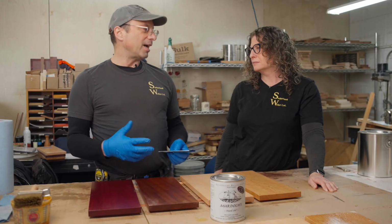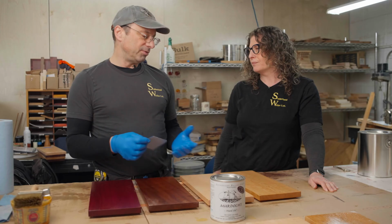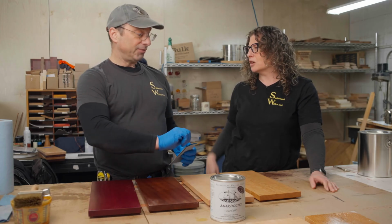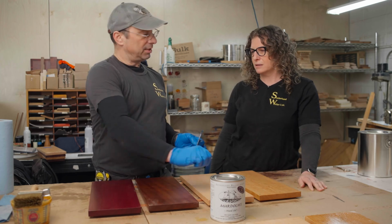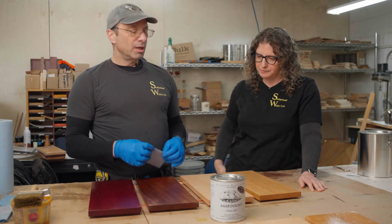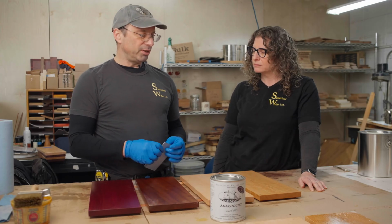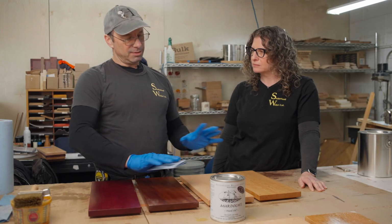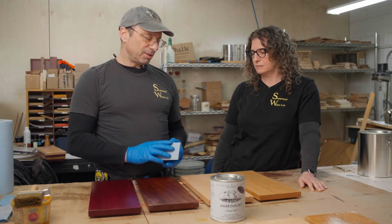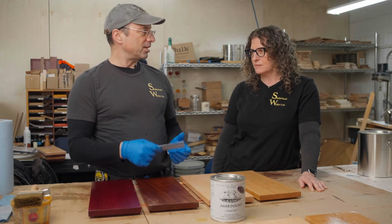Sometimes you can get away with knocking off the stuff that's just a very thin film on there. I've seen people use a brown paper bag, after it's cured, after about a week, you crumble it and it knocks off that top stuff without killing the sheen. Other people have created a slurry with the finish, scuffing it, blending it, and wiping it again. There's a bunch of different ways, but usually the best way is to get your money coat without dust.